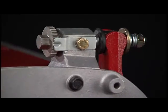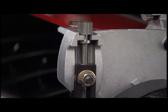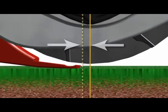There are only two simple adjustments on the DPA cutters: one for the bedknife to reel, and the other for the cutting height. That's it. Keeping the bedknife and reel in the perfect position, angle, and distance behind the center line of the reel is the key to achieving consistently great quality of cut.